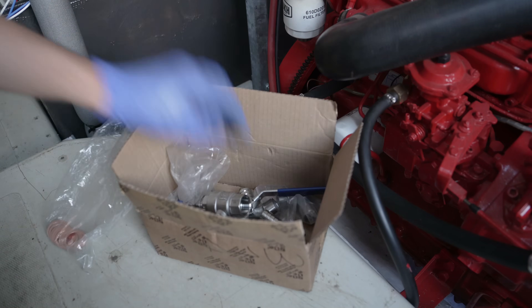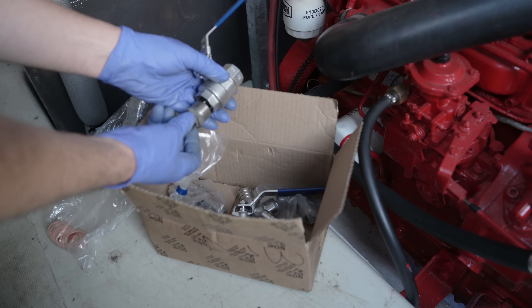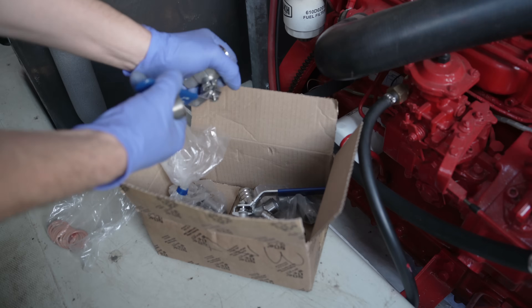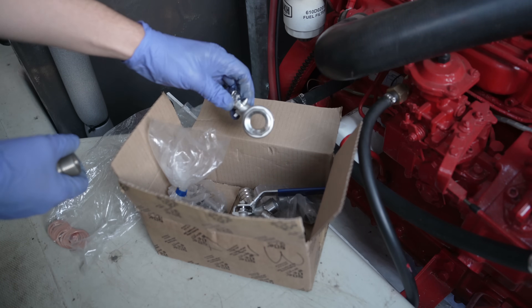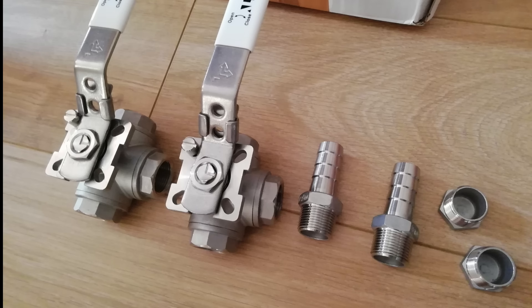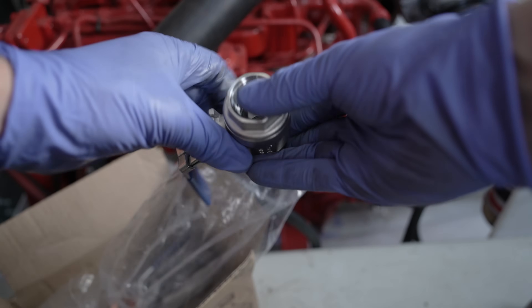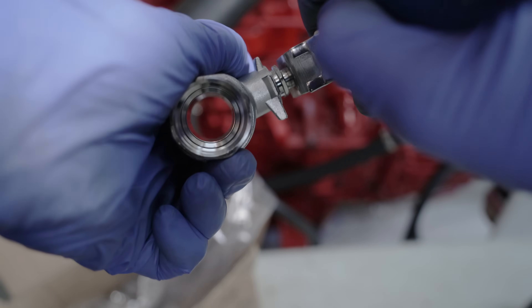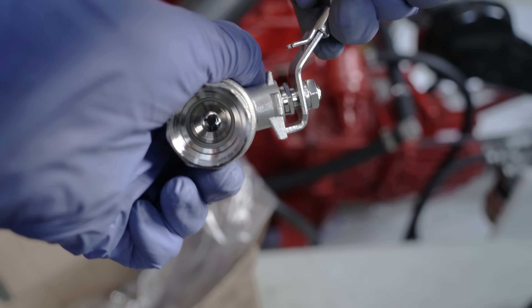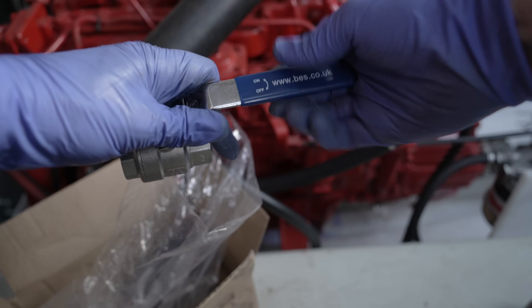I'm installing valves just inside both of the keel cooler through-hulls. This means I can control flow, and if the keel cooler is damaged and letting in seawater, I can isolate it, and then attach a backup over-the-side cooling loop. I did try first with L-port valves, but their architecture is a lot bulkier in a space-constrained zone, and these had a reduced flow design. Instead, my emergency changeover plan will necessitate a little hose cutting and reclipping, but I think that's a fair compromise. These stainless steel valves are full bore, so no getting in the way of my indomitable torrents of coolant.